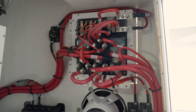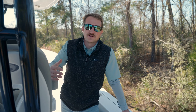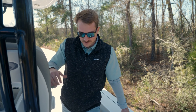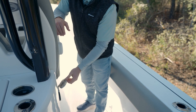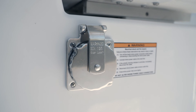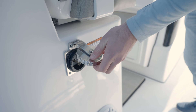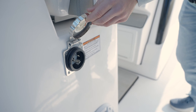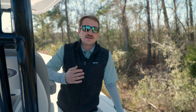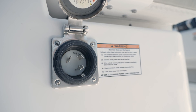The last feature of this Mastervolt system is a shore power outlet. This is going to make things very convenient for those of you who keep your boat in the water and have direct access to shore power. For those who do not, it also comes with an adapter that plugs into the shore power and has a 120-volt plug directly in the back, so you can charge your boat from home at any generic outlet. This system is also safe to leave plugged in for months at a time — if you'd like to leave it plugged in over the winter, it has a float system that will not let the batteries get overcharged or overheated.